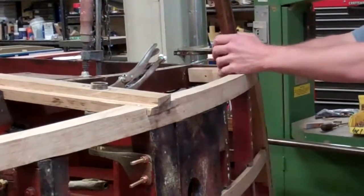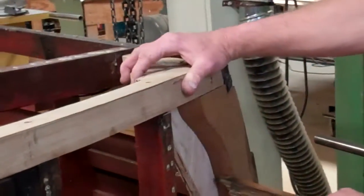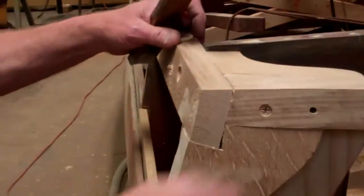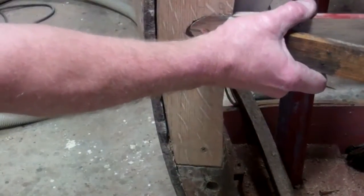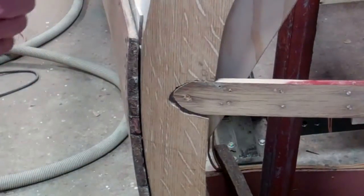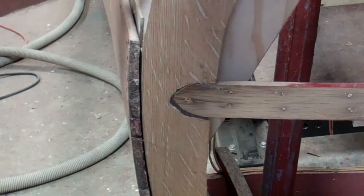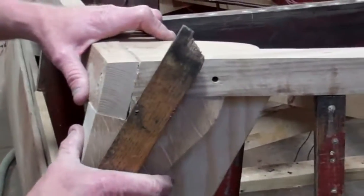I had to mirror-image this corner to that corner over there and got that all set. The only thing is we take it apart quickly, seal it, and then bolt it back together. When I put it all back together, these two pieces of wood are supposed to be like one piece, so I'll actually epoxy those two pieces. But anywhere where a separate piece of wood goes into it, I'll put some 5200 behind it and put the screws and bolts back in — that will allow it to work a little bit but it won't loosen up. Originally there was no adhesive or sealer behind the boards and they all loosen up after a while, the screws get loose and everything loosens up.